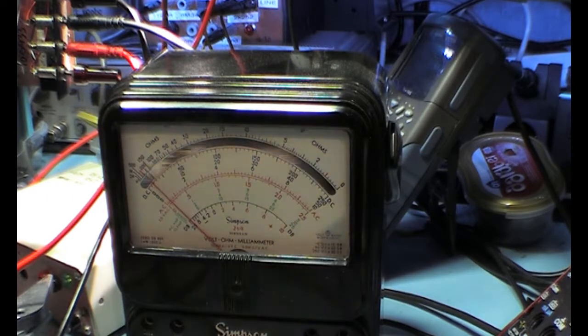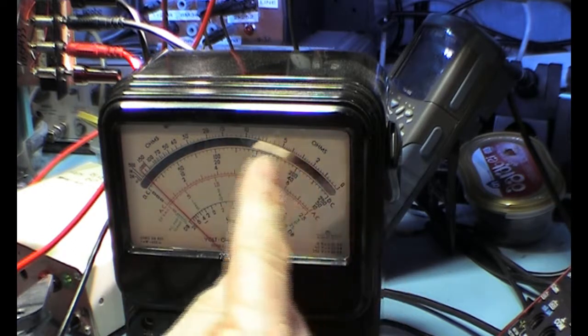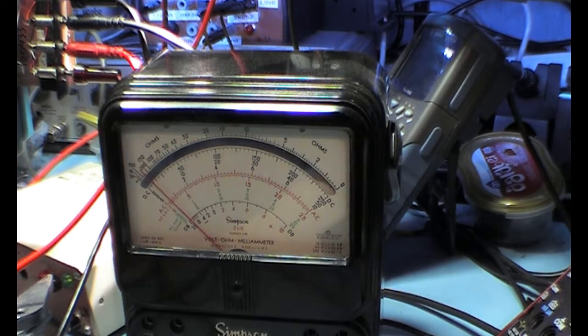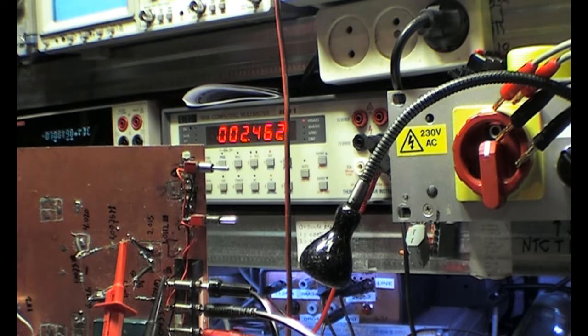So we can go back one position to the 2.5 volt, and in the 2.5 volt we use the upper scale. And then it's still thinking that it's only measuring a few millivolts or so, because I'm very bad at reading those scales. And so this is 500 millivolts, and then we have here, so that is something over 200 millivolts that it's reading. That is not really a lot, but then if we look at the current that it's drawing, it's 2.643. So that's a lot more current.